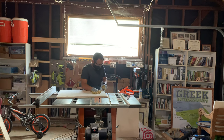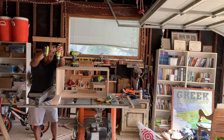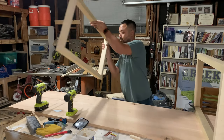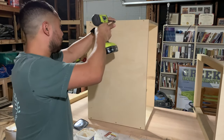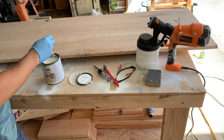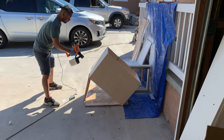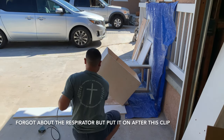After completing the rabbet cuts I took a chisel to clean out the cuts and counter-sunk some pilot holes before eventually gluing and screwing the side panels together. Once my legs and center shelf were assembled, I wanted to bring everything back to make sure all the screws were pushed in deep enough so I could put wood filler in all the holes and eventually paint over them. Next it was time to bust out my HVLP gun, stir some paint, and get ready to blast it down. I painted two to three different coats of paint primer, letting it dry an hour in between before laying down the next coat.